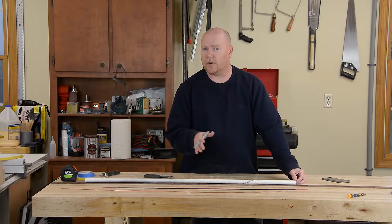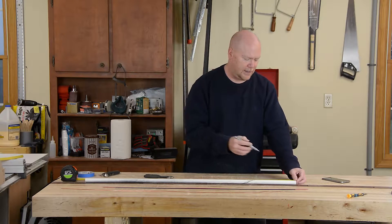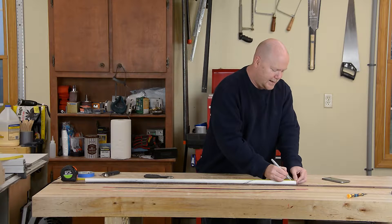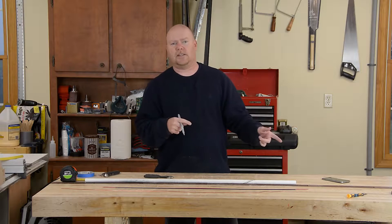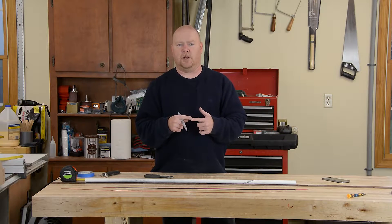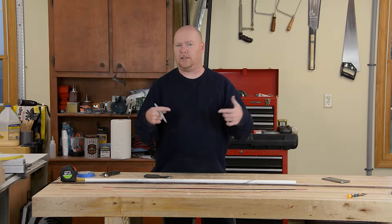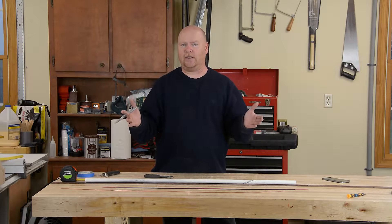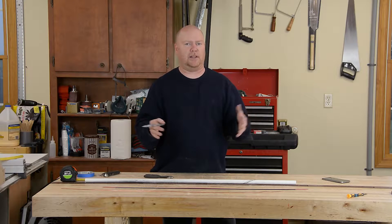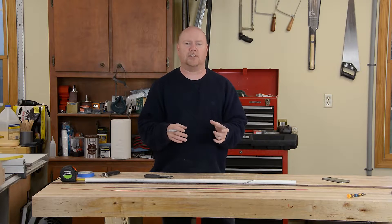Next step is to mark the boom for where the antenna elements go. The director essentially goes at the very front of the antenna — I'm gonna mark it one inch back just to leave room for my fastening system. The plans I've got, and I'll leave the link in the description below, actually make this antenna out of two 18-inch sections of PVC attached with a T in the middle, meaning the entire length was supposed to be 36 and a half to 36 and three-quarters inches depending on the dimensions of that T.